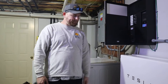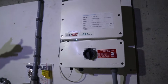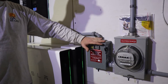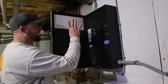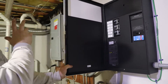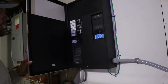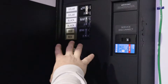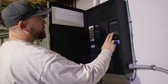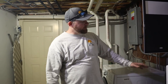One final wrap-up: power comes down from the modules, goes into the inverter, changes from DC to AC, goes through all of these components which track production and allow a means of disconnect in an emergency, then goes into the gateway which is the main service disconnect for this building. The existing electrical panel is now considered a sub-panel, which means all grounds, bonds, neutrals, and grounding electrode conductors all have to come back to the main here. The solar supplies power to the building first, and any extra power above what the building is consuming flows through the main breaker back out to the grid. That is a brief overview of the SolarEdge solar system and the Tesla Powerwall system.